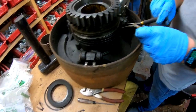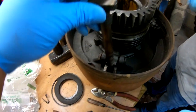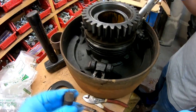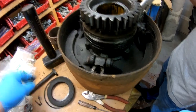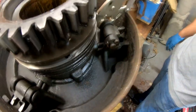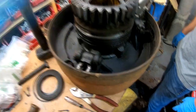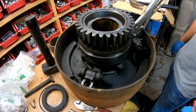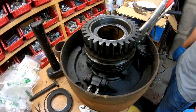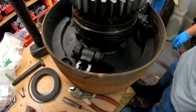The T-bolts slide through the clutch dogs themselves, and they're held onto the front. Those are the three bolts you see come through the front on the clutch cover. They have two sets of cotter pins on them, and then you've got your dogs here. We've already found a broken clutch dog, so we're going to go ahead and remove all these, clean everything up, and probably remove this portion, clean all that up, and degrease the entire inside of the pulley. It's just a matter of removing these cotter pins — the pins slide out and the dogs come out.